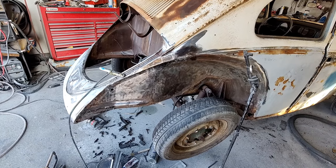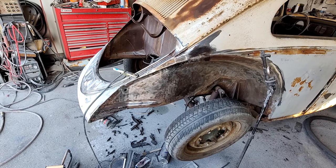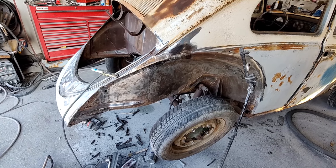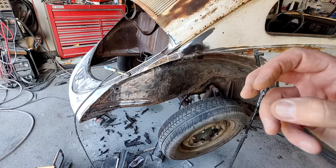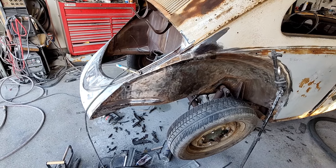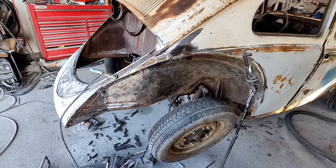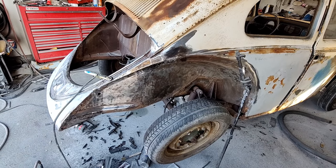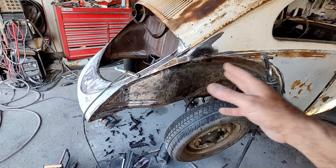and then right away go right in. Wait about 30 minutes or so. Wait till it's at the right time, you've got to know. And then you can do it without sanding it. It'll go right into it with the urethane primer. It has to be just to where it's starting to catalyze pretty well, but not so hard that it won't bite to it. It's kind of a practice, so it takes time to learn that. So then I'm going to go over it with urethane primer right after that, so I don't have to sand it. And then I'm going to sand the urethane primer later and paint, but I'll be doing more body work to it. But I want to get the filler on first.